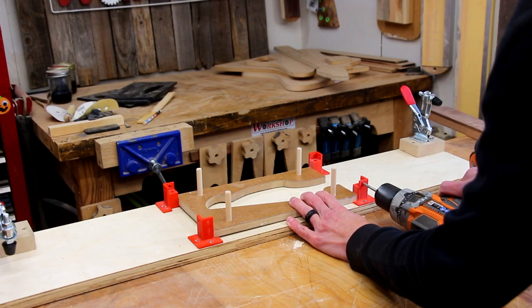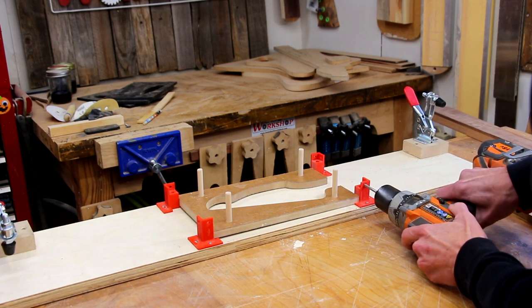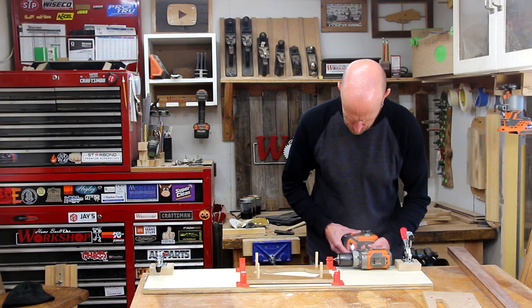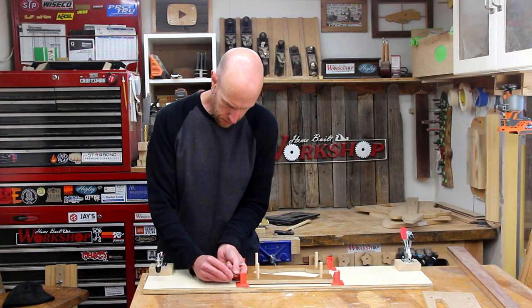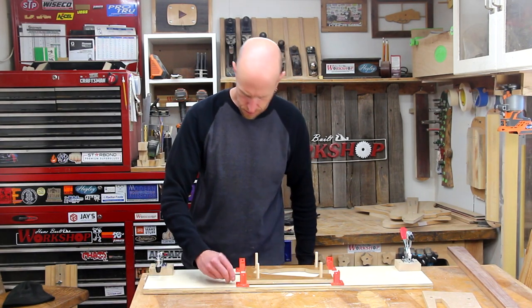These pieces are basically just made of plastic, so they're not going to be super durable, but I'm not really worried about the screws stripping out because it's just going to apply a little bit of tension just to help hold that top template in place and keep it from wiggling around. If at some point it does become an issue, I can easily reprint these and use some threaded inserts to help make these more durable.